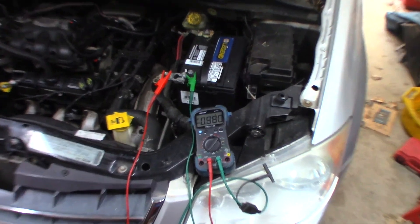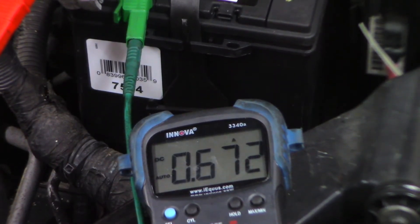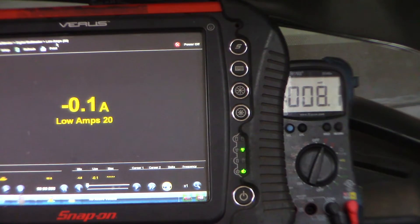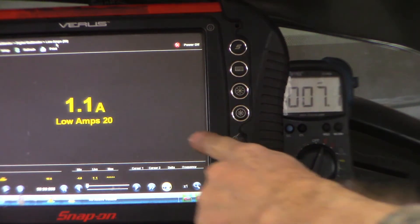Maybe you can't see that — let me zoom in for you. There it goes down to 980, 600, 600 milliamps, 0.6 amps. Right back to 2 amps in less than a minute. Something's cycling. So we have two different things going on — they're both pretty high. You can see my amp reading on the yellow just jump up: 1.1 amps.